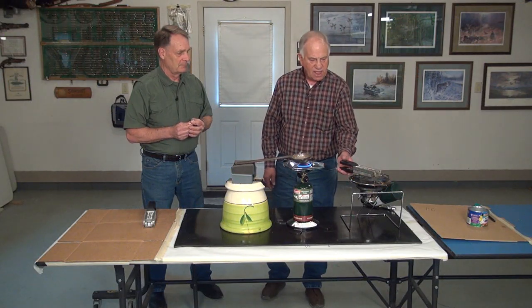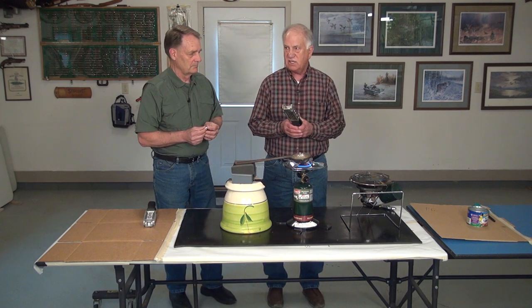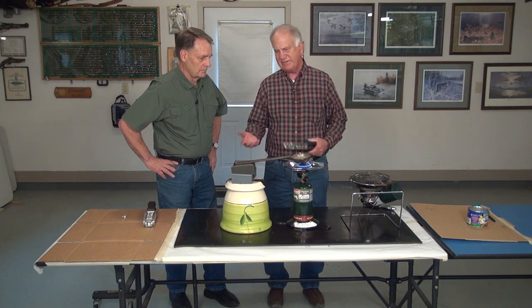Now we're on our next step to making a jig — we're in the lead melting stage. I'm using a banana type or style of mold. One essential thing when pouring is to heat up the mold. If you don't, when you pour the lead in, it'll only partially fill the cavity. Lead cools down very quickly — four or five seconds and you're about done with what you can do with it as a liquid.